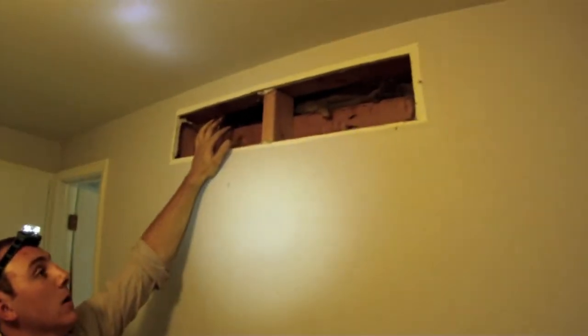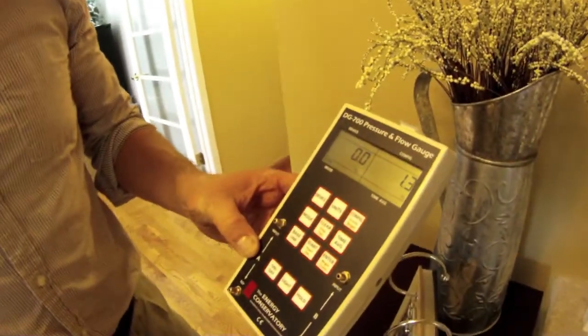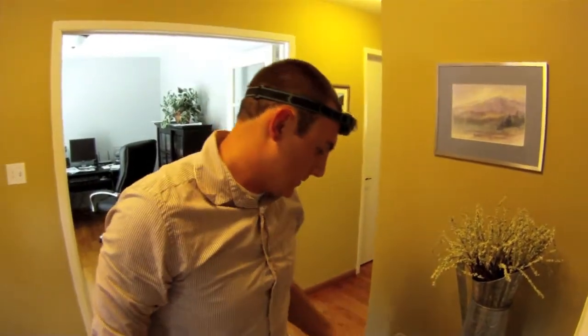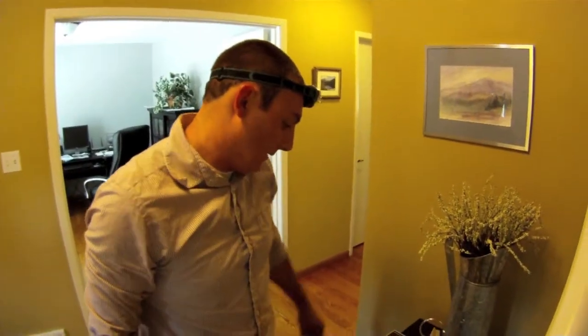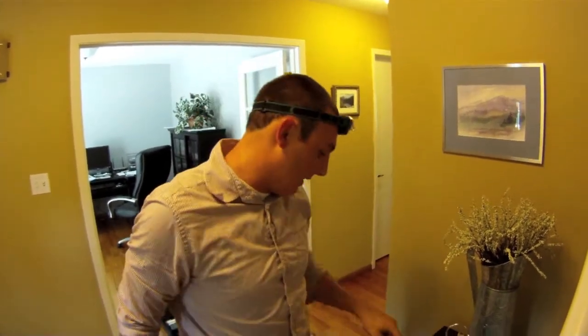This is a huge air output — about 30 to 40% leak on the system. This house, even in worst case scenario, is still a positive number, which means there's bad connectivity. That return line leak is throwing off the whole balance of this entire house. So if the AC is on, all the fans are on, all the doors are closed, the house is in worst case scenario, which means it's got the biggest negative draft you can have on it. Every fan in the house is trying to pull air out of the house and you still have a positive pressure.